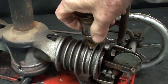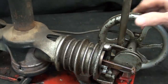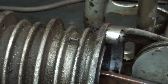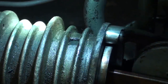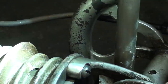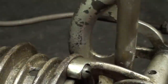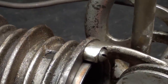Obviously someone added this drip oiler, though I didn't think of that myself until somebody suggested it. Zooming in here — that is the piston you're seeing. There are only a couple of threads of engagement, and some of the threads are actually on the fin. That's why I can't just plug it — if I put a plug in too far it will hit the piston.